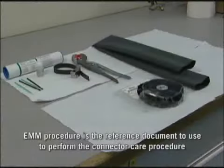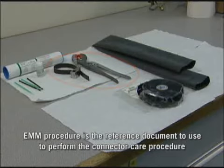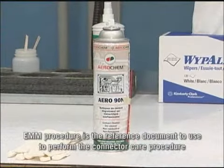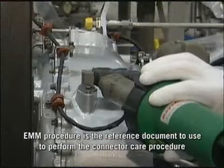The tools and consumables required are soft jaw pliers or strap wrench. Reference PWC tool in engine maintenance manual — in this video it is PWC 89812. Stabilant 22 contact enhancer, contact cleaner, shrink sleeve or insulation tape, and a heat gun if shrink sleeve is used.